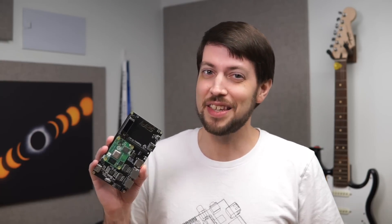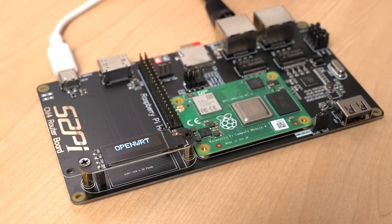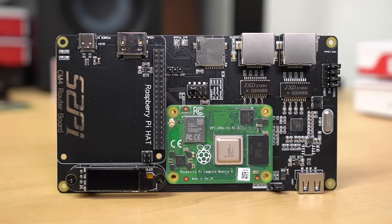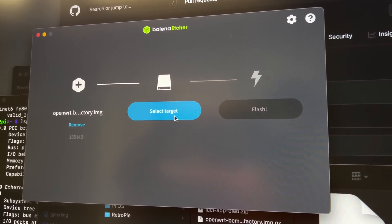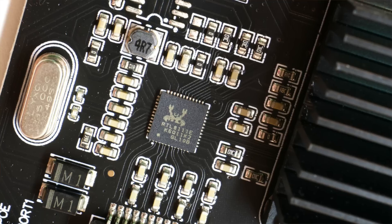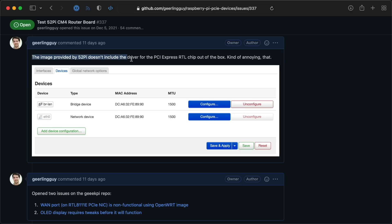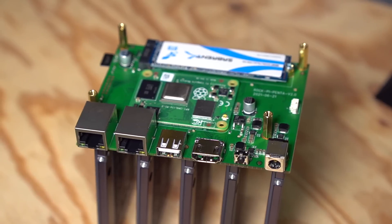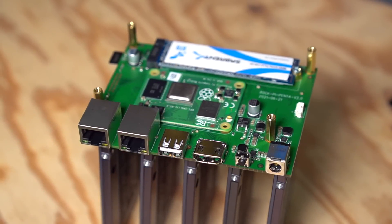With a caveat — more on that later. Moving on from Poland, this next company didn't send me any chocolates, but they did send this neat dual-router board with a built-in OLED display, which integrates with OpenWrt and can show you server stats and IP addresses. It's 52Pi's CM4 router board, and it has 2 gigabit ethernet ports, a full-size HDMI port, a USB 2 port on the front, a full GPIO header, and this nice little built-in OLED display. 52Pi ships their own fork of OpenWrt, which is great if you want to run the board as a router, but I did have some trouble with it. They used a little Realtek PCI chip for the second gigabit port, but the first version of their custom image didn't even have the driver for it pre-installed. So I installed PiOS instead, because just last week, support for Realtek network chips was added directly to PiOS. That's really cool because it means even other boards, like the DF-Robot one I reviewed last year and the Taco with its 2.5 gig port, will work right out of the box with PiOS with no extra driver install.